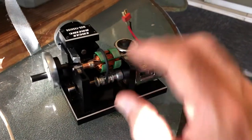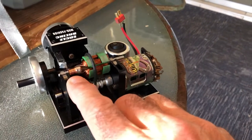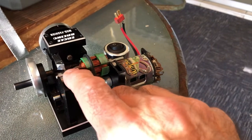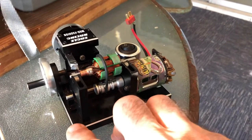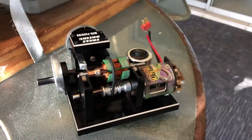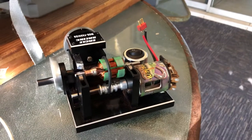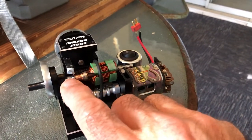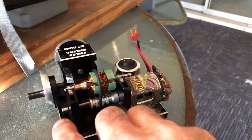We're used to taking a little bit of alcohol, a Q-tip, and an eraser. Some people will go as far as maybe taking a little Scotch-Brite to get the hard crusty stuff off the comm, and others may frown upon it. But I have used 1,000, 2,000, or 3,000 grit abrasive paper. Abrasive paper will cause grooves in your comm, and it may help where the brush seats until they seat properly. Then it'll smooth out the comm eventually.